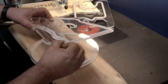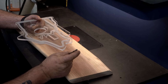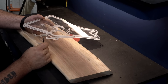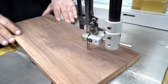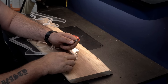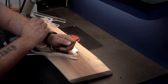Earlier I mentioned we keep a quarter inch bit in our router table almost all the time because we're usually cutting templates. That quarter inch pilot bearing fits into really tight areas so we can get a lot of definition. That means when cutting our templates or material, once we've drawn our pencil line, we want to be within an eighth inch of that line. You never want more sacrificial material left over than half the width of the bit — the closer to the line the better.